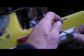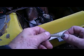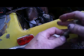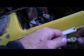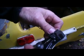Let me show the fuse holder: wire goes in one end, fuse in the middle, wire at the other end. To open it, push together slightly, rotate one half, and pull apart — there's the fuse. In one half there's a wire with a terminal on the end; in the other half, a wire with a terminal and a spring. Everything looks clean, making good contact.